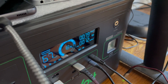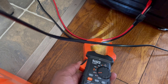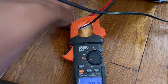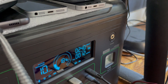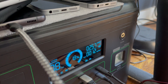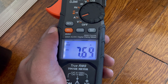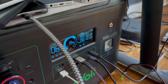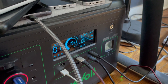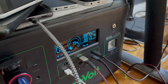The problem is this could still charge, but it had stopped charging — so I just want power coming back in. Looks like it's doing something, which is a good sign. Now for the amp reading, I have to finesse this a bit — you have to be careful not to have the leads touching to get a good reading. I'm seeing 240, 248 — it's going up. I'm getting a typical 7 to 8 amps, whereas before in parallel we were looking at close to 16 amps. So this is operating the way it's supposed to be. I'm even seeing 273 watts.